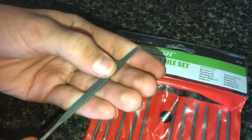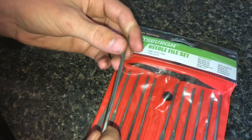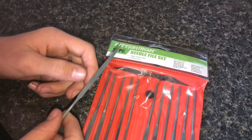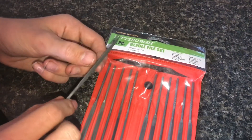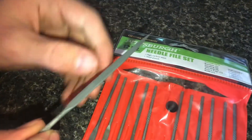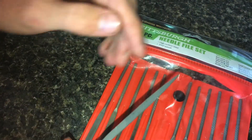These files feel good — they're pretty sharp actually. I've been doing some cutting with them and they take off a good amount of material. With needle files typically you're just detailing things and they don't need to remove huge amounts of material; that's why they have a finer tooth, which leaves a better finish, takes off less material, and is easier to control.